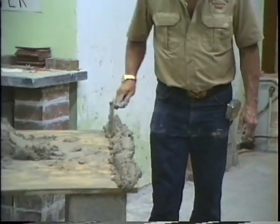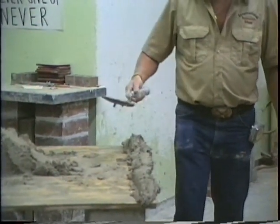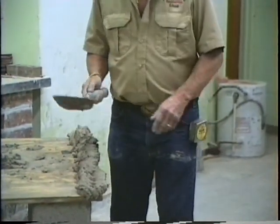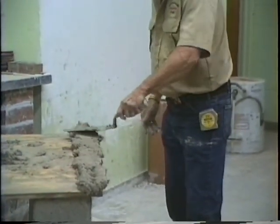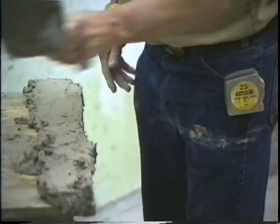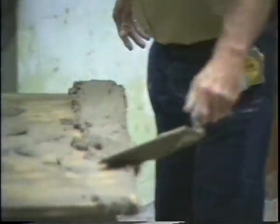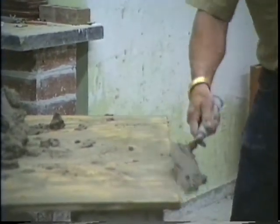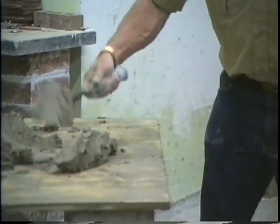Roll that mud out. There we go. All right, now, as I've showed you, here's furring the mud, okay? But here's flattening the mud. It's when you just take it and flatten it out, okay? In other words, instead of furring, you flatten. Now we're going to go through that one more time so that everybody understands it. So if somebody tells you, don't fur the mud, I want you to flatten it, well then, here's what you do.